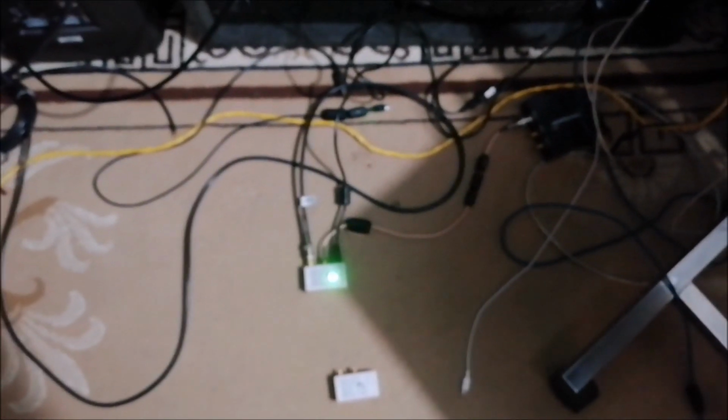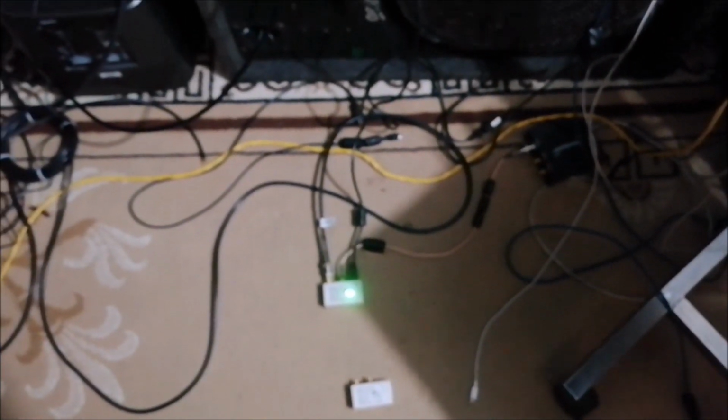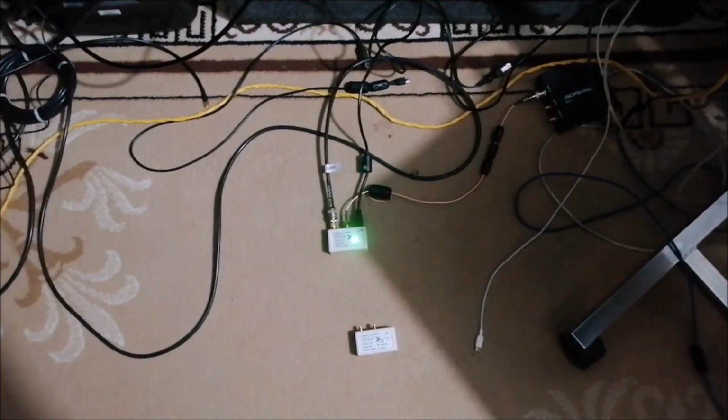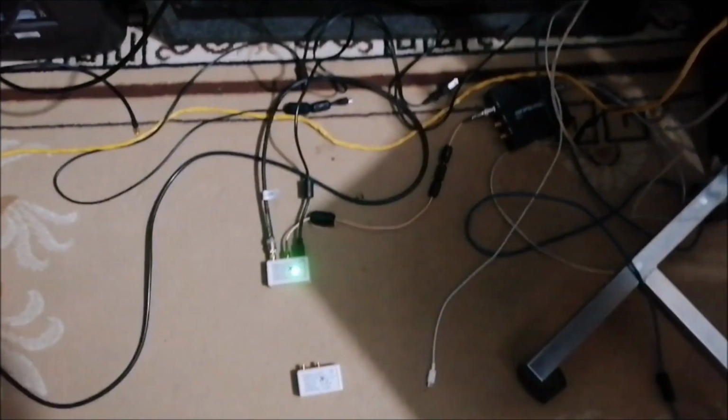So that's how I set up my copper modified MLA-30 to get VLF. The lowest signal I got on that was 24 kilohertz. That was Cutler, Maine. That's a submarine transmission. Okay. Right now, let me check the time, it is 5 o'clock in the afternoon.